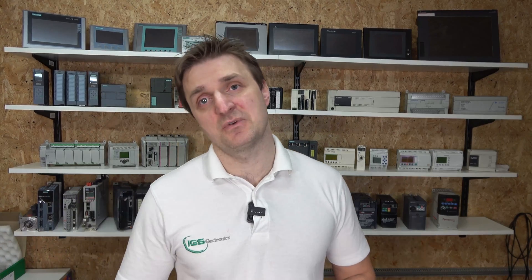I'm going to need a bit of help from this guy — this is an RS-485 and RS-232 cartridge for this specific unit. That's the one we're going to be adding in today. We're going to set up and have a look at how that works, transfer the drive from one serial port to the other. I'll show you how I do that, so let's get started.